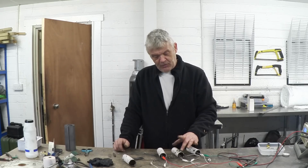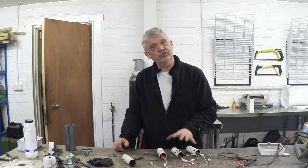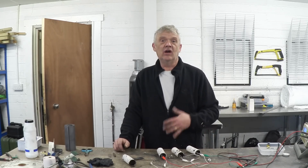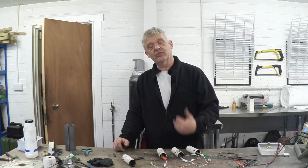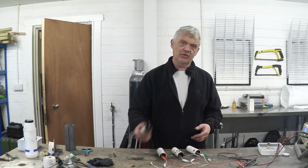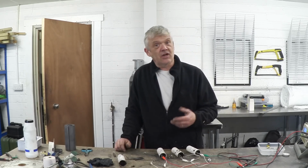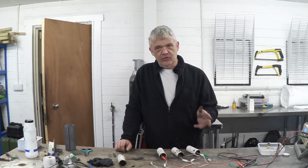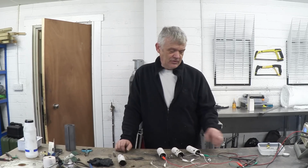But pulling them out of the ground and connecting them in series, we get 1.3 volts. That's not the issue. You can do that really easily. You can connect them up in series when they're like this and get the voltage increase that you're looking for. The issue is getting that when you're putting them in the ground. And it seems that putting them in the ground by isolating them with a little bit of plastic pipe around each electrode before you add it actually has the desired effect. Like I say, that was pulled really from a couple of research papers and a patent particularly that I read that I thought was interesting.